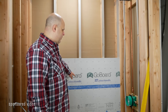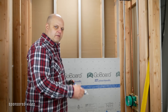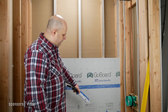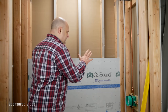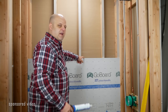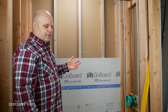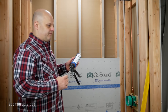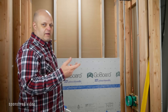There are two different ways to install GoBoard. One is to apply sealant to every edge prior to putting the board in — you'd apply it on the bottom flange, put the board in, apply sealant on the edge again, then put the next sheet on and compress that sealant. Today I'm going to show the other method: put all the board up first, then come in with the sealant later. That way you don't have gloves on and you're not moving back and forth with the glue.